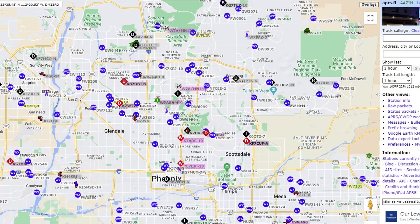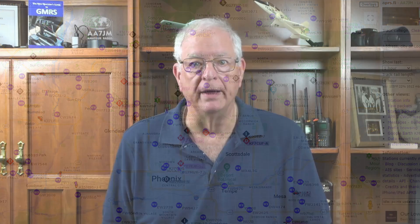The most popular APRS messages are position reporting beacons. You have several choices when choosing how often to beacon out your position. These packets are picked up and can be displayed on a map. When going to a site like APRS.fi, you or anyone else can enter your call sign and time frame and see a track of your travels as reported by your beacons. This feature is quite helpful when you're out in the back country, so long as you're within digipeater coverage — folks can see your location, which can be quite helpful in emergencies.